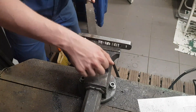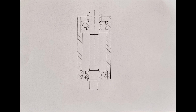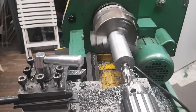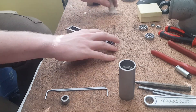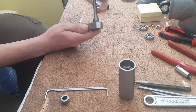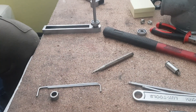Oh boy, I am going to be so happy when I can do stuff like that on the mill. Next up I started to make the shaft and bearing housing. The bearings are your regular skateboard bearings, assembled in a floating bearing arrangement. Let's assemble it. First I mount the shaft onto the moving part using some Loctite and water pump pliers. The right way to do that would be to add two flat spots so you can tighten the shaft with a wrench. Then I added the bearing assembly.